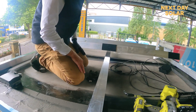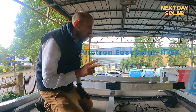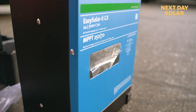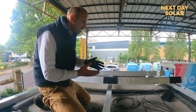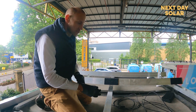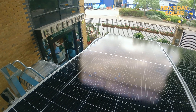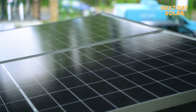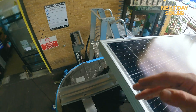We've prepared the roof and made sure it's watertight. We're fitting a Victron Easy Solar 2 GX device which is going to manage the system and work well with our batteries. If we ever do manage to plug the kiosk into the grid, we can use the energy in the battery first and then use the grid, and use the grid to charge the batteries if they're low. We've just installed two panels — there isn't a great deal of space but we're maximising it. It's not a grid-tied system to AC, so we can relax a few requirements; MCS guidelines require 22cm clearance but here we don't need to follow that.